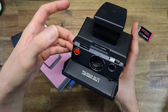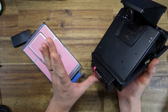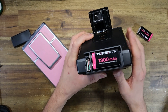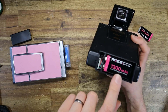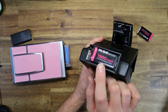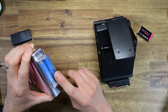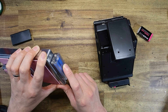It works exactly like the camera should, with a super rock-solid 6 volts coming out of the little built-in buck converter. Super powerful. The other big advantage I believe this battery has over the standard PolarVolt is this battery is a much larger capacity, rated to 1300 milliamp hours. Depending on the 10440 cells you get, most of them are around 350 milliamp hours, although I do have a set that say they're rated to 1000.